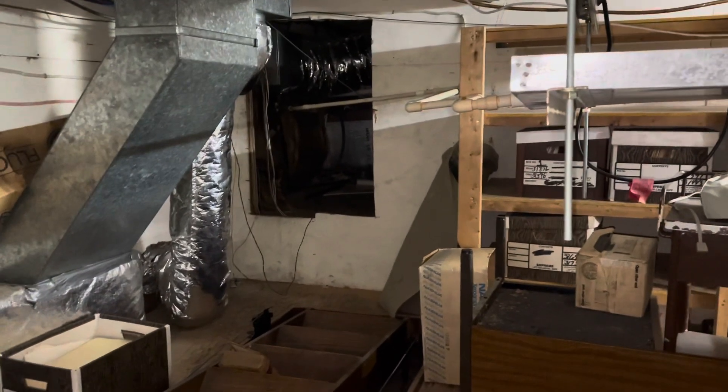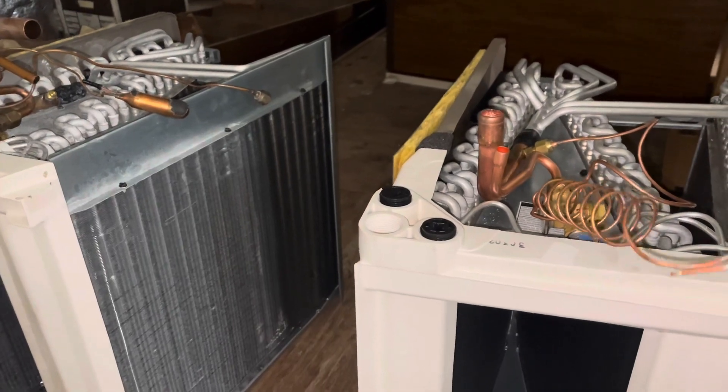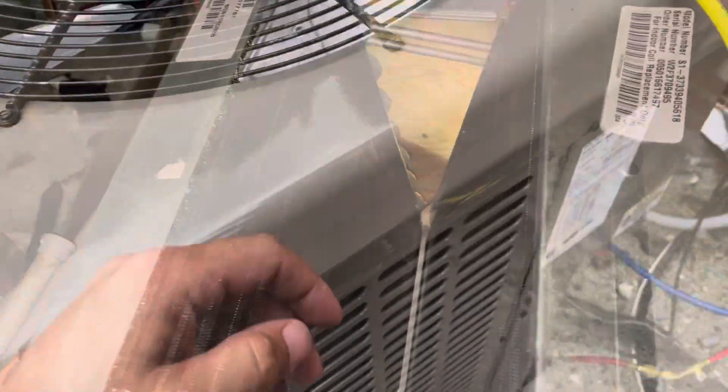It had to be the one in that little hole. So we're going to shove this coil back in there and see what other fittings we need to make up to get this thing to work. This coil came like this from York — I just realized it was purged with nitrogen, so there's no leak. Still not how you want to receive a new coil. That's crazy.